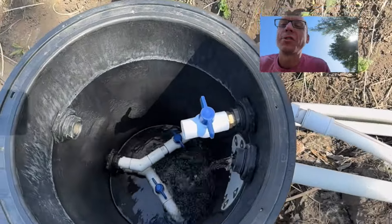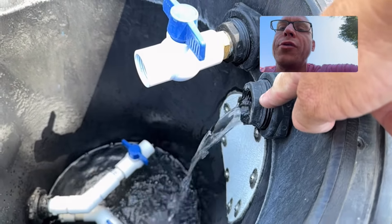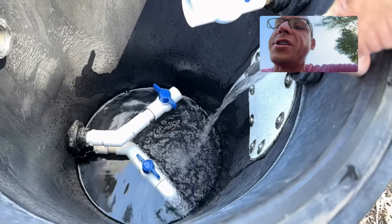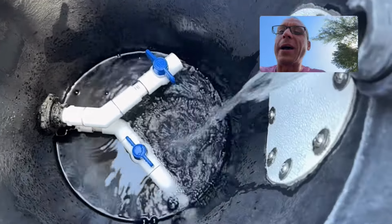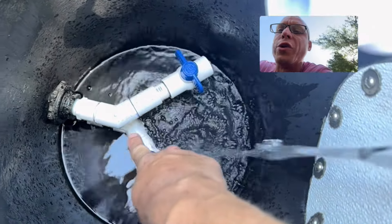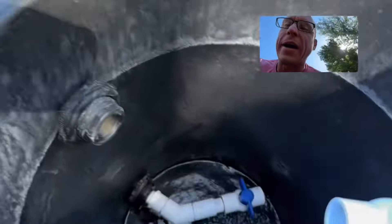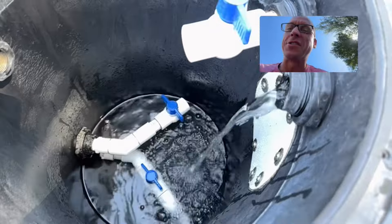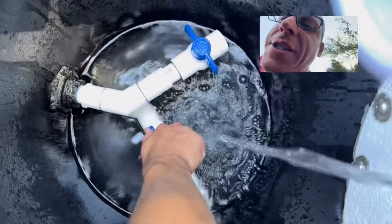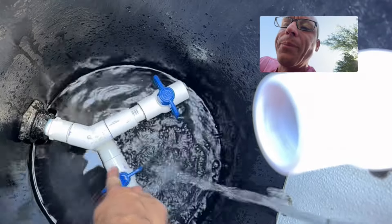This is the ram pump buffer tank, which also acts as a secondary silt trap. This is the ice-cold mountain spring water flowing in from the 2,100-gallon concrete water cistern. When the buffer tank is in bypass mode, all the water flowing into the tank is being sucked off the bottom out this lowest fitting, which travels downstream and bypasses the entire system and runs back onto the ground — that's how I get all the silt out.